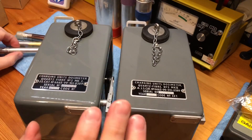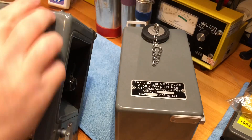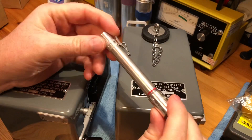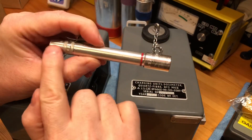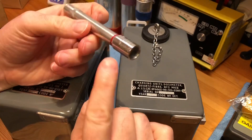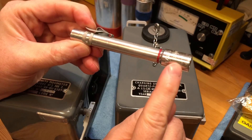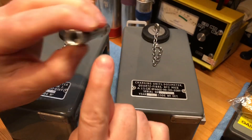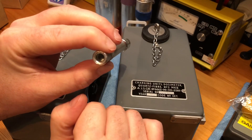These are magneto charging units, so there is a handle on the side. You would put the dosimeter in the top hole and turn the handle to charge it. Inside, there is an air-filled sealed cylinder ionization chamber. At one end there is essentially a microscope, and at the other end there is a little charging pin. Inside there is an electrode strip connected to the charging pin, which goes all the way up to the microscope where there is a gold-plated quartz fibre. When you look through the microscope end there is a scale, and you can see the quartz fibre inside.